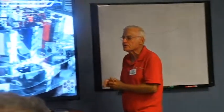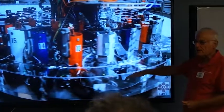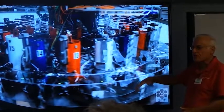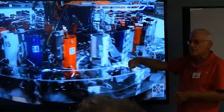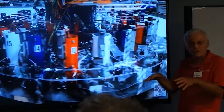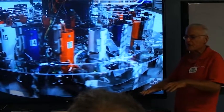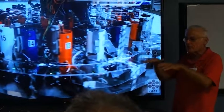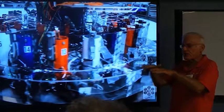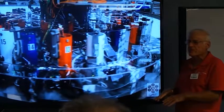The other thing which is going on simultaneously is when we put a mirror under the test tower, the test computer tracks all 1,750 of those geometric shapes, and it's telling the polisher, press down on the high spots, ignore the low spots. So in real time, you're having this thing go up and down while it's changing its morphology at 10 times a second.